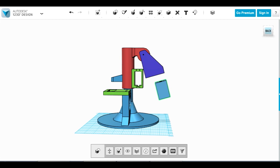So I've built the arm like this with the joints attached in that order for a specific reason, and that's to do with the type of angle that comes out of the inertial measurement unit, which are called Euler angles. So we'll look at that in a moment, but for now I'm going to print and assemble these parts and get all the servos in.